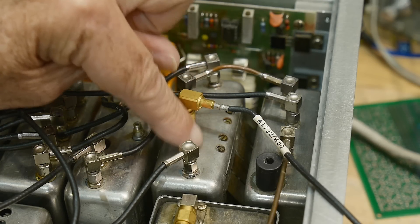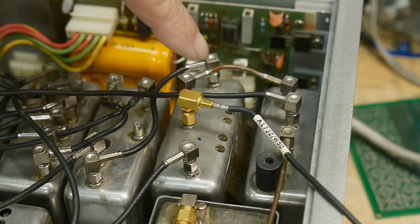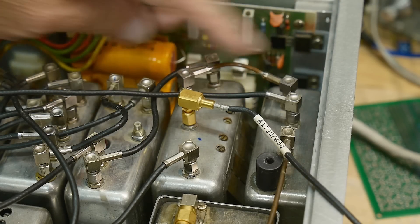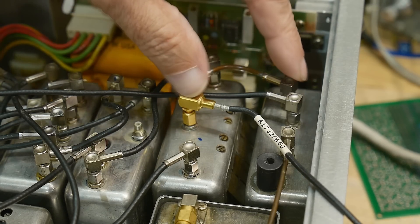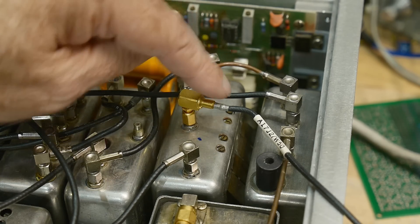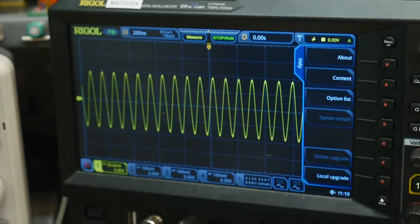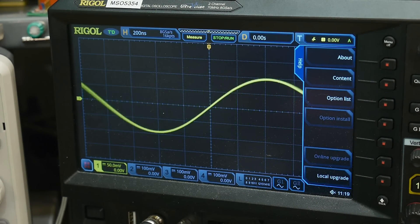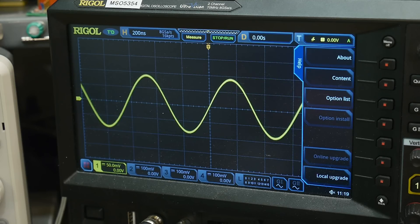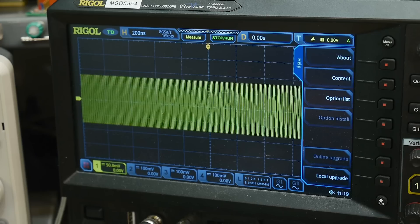This is the unit that drives the amplifier. I backed up one stage so you can see the connection here is broken — these two points are generally connected together. I'm looking at the output of this upstream unit and everything looks lovely. 10 MHz, even one megahertz, 100 kilohertz — it's working really good.